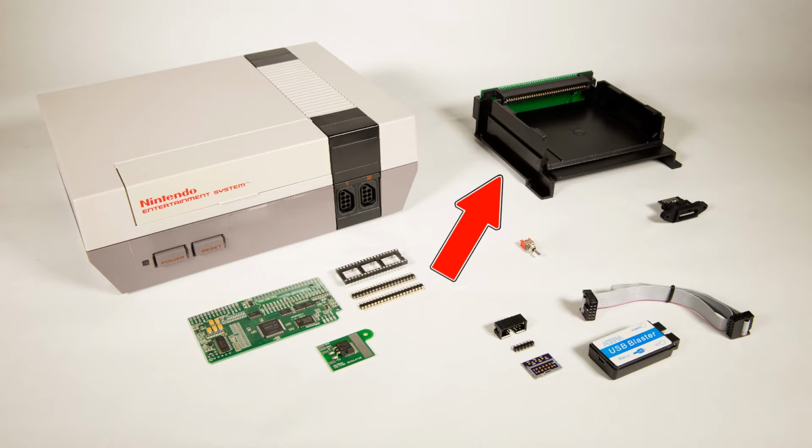In the upper right hand corner is an oddly named product called Blinking Light Win. It was originally funded by a Kickstarter campaign and solves the other major problem of the NES, which is loose connectors. The 72-pin connector of the original NES would get loose and stop making good contact with the games. When a game didn't make a good connection, it wouldn't load, and the system's power light would blink, thus the name it was given. This product has a better design than the original connector and solves the loose connection problem that would cause the power light to blink.